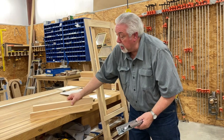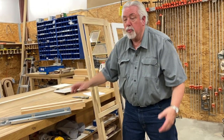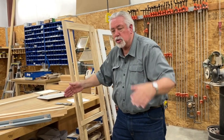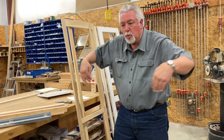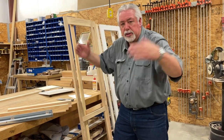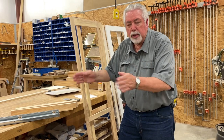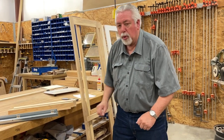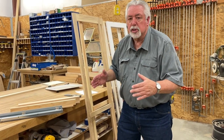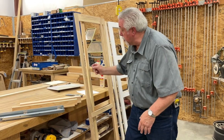So the little spacer blocks, large ones on one side, skinny ones on the other. And the doors on these two pantry units, the doors will hinge to the outside, so they open toward the refrigerator. The large mounting block will go on the side where the hinges are. The small mounting block will go on the inside toward the refrigerator, and that will allow our mounting blocks to be maximizing the space that is available, but still giving us spacing out from the face frame.